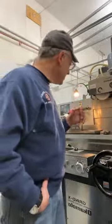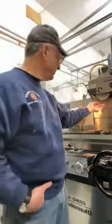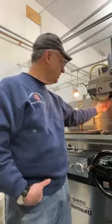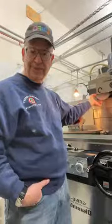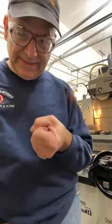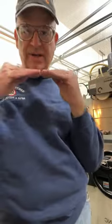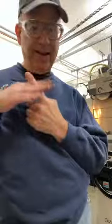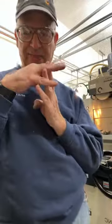All right, the spindle is off. I know you can't tell on the video. So if I feel the wheel, I can feel the diamond roughness. If we trued that wheel and we didn't dress it with the dressing stick and I went to feel the wheel, it would feel smooth because the resin might be at the same level as the diamonds and it's not going to cut well. So we go in there and we dress it and that makes the diamonds proud of the resin.